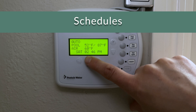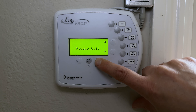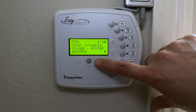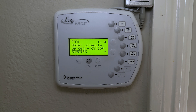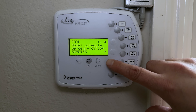Another basic feature is adjusting your schedules. Hit Menu, scroll down to Schedules, and press Select. You can see one schedule for the pool and two for the waterfall. The pool schedule runs from 9 a.m. to 3:50 p.m. every day, running the filter pump. I have it stop at 3:50 because at 4 p.m. electricity prices increase significantly — so you can save money by running the pump outside peak hours.